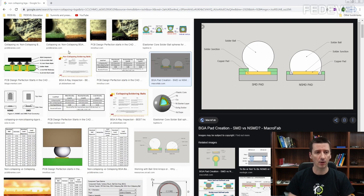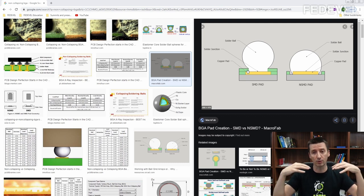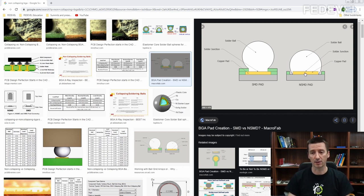I searched for some pictures about collapsible and non-collapsible balls. This picture is from Tom's company, PCB Libraries. You can see the solder mask actually goes and covers the pad in one picture, while in the other the mask doesn't cover the pad. On collapsible balls the solder flows down the side of the pad, and on non-collapsible balls that side of the pad is not soldered. Ideally you want to cover it with the mask so it basically glues or holds this very small pad a bit stronger.